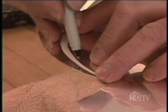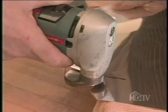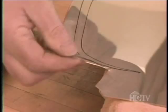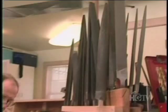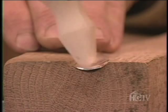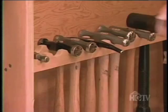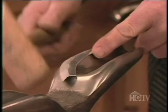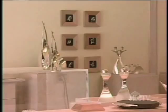This afternoon Michael is making one of the Banners' sinuous handles, a reflection of their love of nature. He cuts two matching slivers of silver. 'What we're making is going to be called Lucifer, because there's a plant that comes up like this, it comes over, and the flowers all hang from the top.' Then he starts hollowing the handle, using a small nylon hammer to push the silver into an indentation in a block of wood. He refines the shape against a curved steel stake, then planishes the silver. 'We're trying to smooth the metal — getting all the major ups and downs out, making it perfectly flat.'